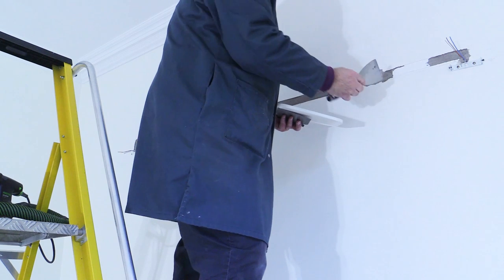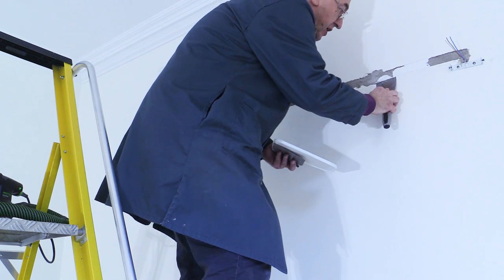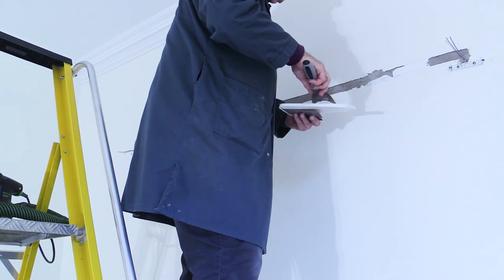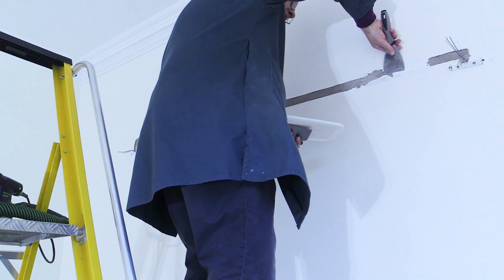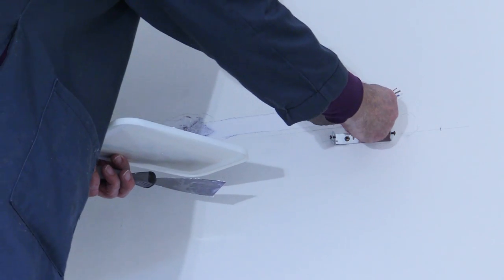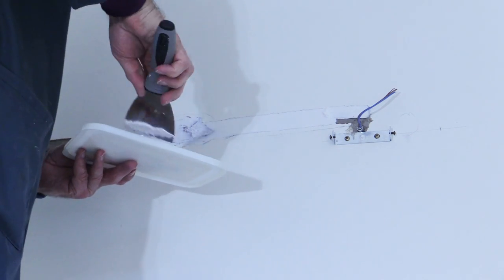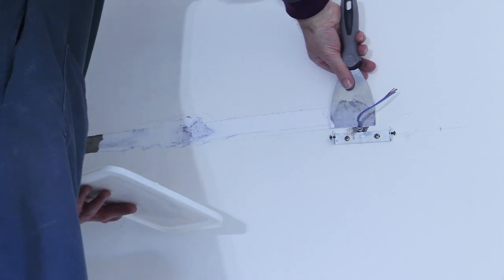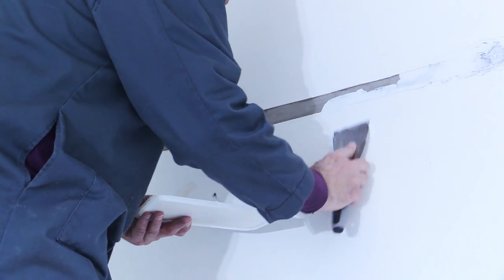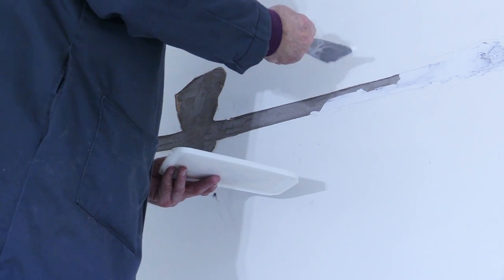This is probably the first time I've done this in public as it were — you have to understand I'm not an expert at this and I hate doing it, but I'm going to do my best. The trick I've found is that when you've got some on the palette knife, go downwards into where it joins the existing flat surface, and if it's at the top go upwards into it — that way it squeezes stuff right into the joint. Do remember to make sure you've turned the electricity off when doing this sort of work. Well, this is going far better than I expected — much easier than I anticipated. This cheap and cheerful stuff from Screwfix appears to be perfectly good.